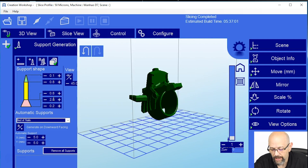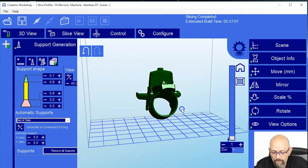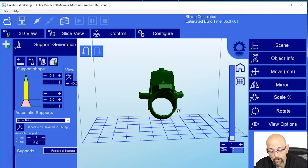What I like to do typically is use a 0.1 millimeter tip. And just to make sure things stay sturdy, I go with a 0.8 millimeter barrel for the support, and then a 2 millimeter base. It can be bigger or slightly smaller — it's up to you. Keep in mind, the bigger you go, the more resin you use, and resin is quite pricey.